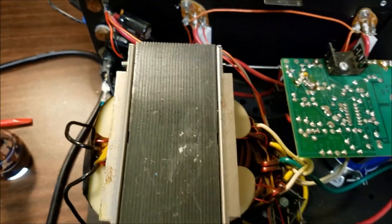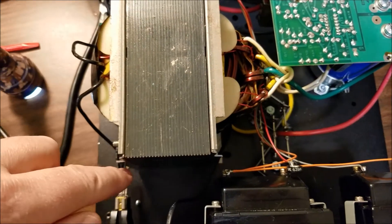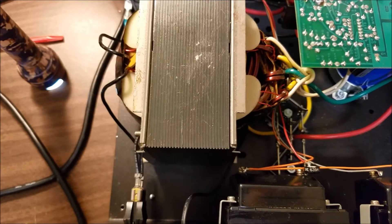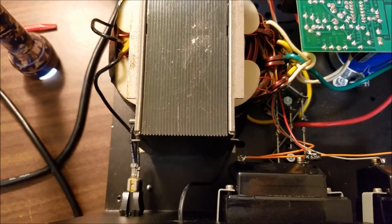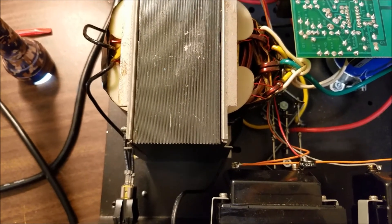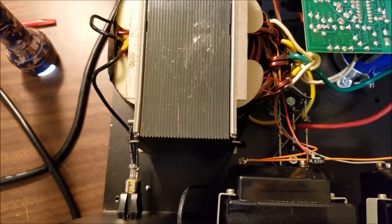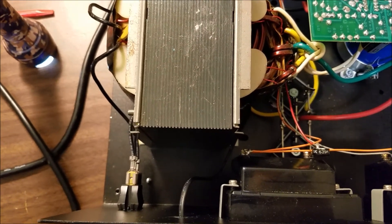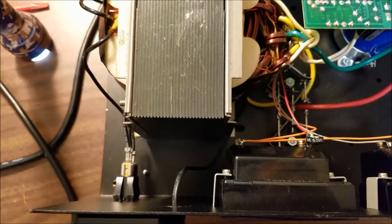The only other suggestion I make is this area here. I masked it with masking tape or blue painter's tape, so when I drilled any shavings — and when I filed later, any shavings — would not get inside the power supply. I then vacuumed it out before I took the tape off, and then blew it out with a compressor at about 100 psi of air.